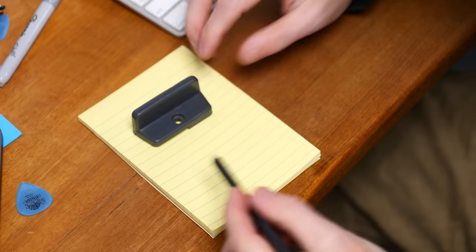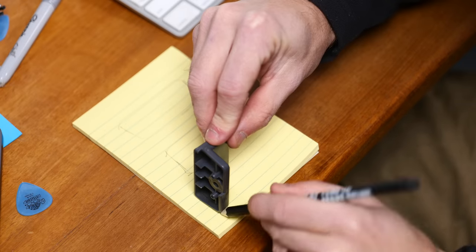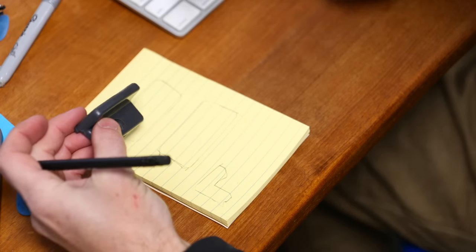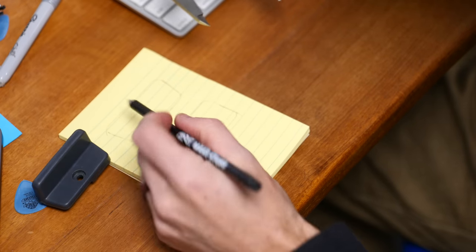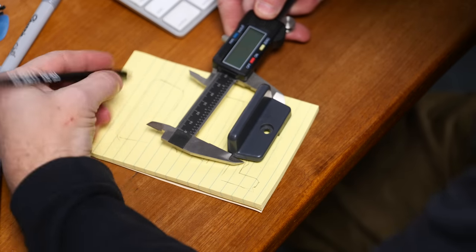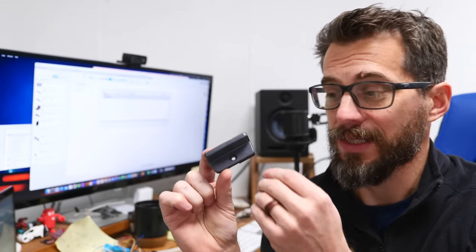You don't actually have to recreate the whole piece — all you really need to copy are the mounting points, how it's going to interact with the thing that is fixed inside the car. But in our case, we're going to try to recreate the entire piece. I usually start by tracing the outside edges of the thing itself. This gives me a clear point to draw dimensions on so I don't get confused later. You can take each profile, measure everything you care about with calipers, and write those numbers right around the drawing. Just note that you won't really know all the things you need to measure until you start modeling — you'll find lots of little tapers and thickness changes you didn't think about. So just go back and get measurements as you need them.